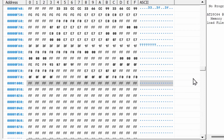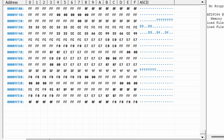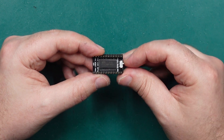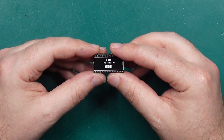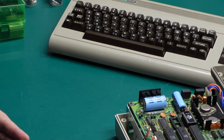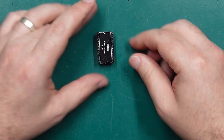Looking at the character ROM, it only takes up four kilobytes and the EEPROM has eight kilobytes available, so I thought maybe we could have a switchable character ROM — and that's what I did. This one has the same 28C64 EEPROM on the bottom but with some slightly different routing and the inclusion of a little switch, so you can switch on the fly between the original Commodore 64 font and the PET-style font. The reason I went for a little switch on the underside is to keep everything as neat as possible on the top side, and I don't think people are going to be switching this that often — so it's not really worth routing it to an external switch on the Commodore 64 case. From the top, you can hardly notice it.